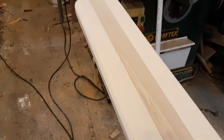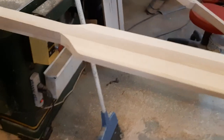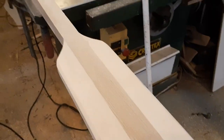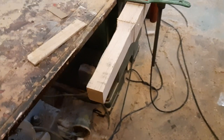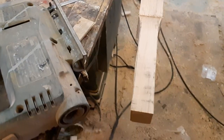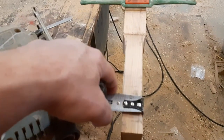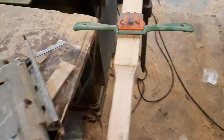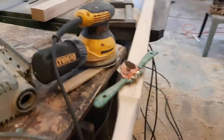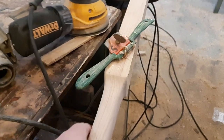The other side does have a bit of knot, but it's up high and it's not all the way through, so it's sound enough. I used a jigsaw — really rough — and roughed this out. Just measured from each side, a rough measurement. I'm a little over an inch. And then, of course, I'll use a spokeshave to round it all off. I also used a palm sander with 60 grit and a spokeshave to rough-shape it.